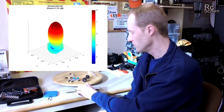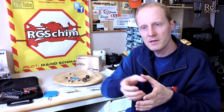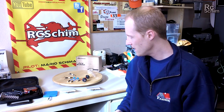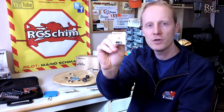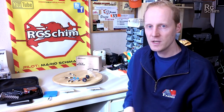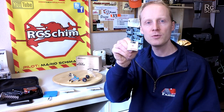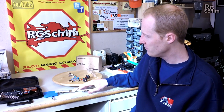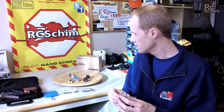That's what directional antennas do — squeezing the balloon narrows the beam width but makes it longer in one direction. On a highly directional antenna you get a bucket shape rather than a donut. What I find convenient with patches is this really tiny Immersion RC 8 dBi antenna, which is a good compromise — about 90 degrees of beam width with 8 dBi gain, giving more range. It's the perfect size for mounting directly on FPV goggles.